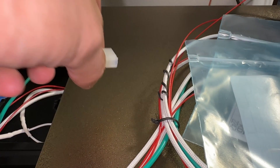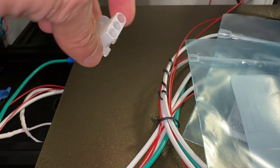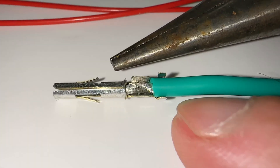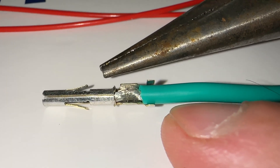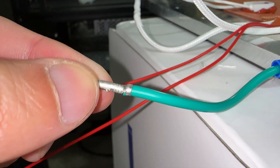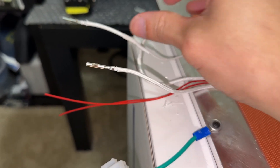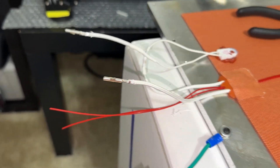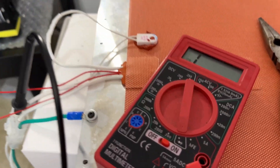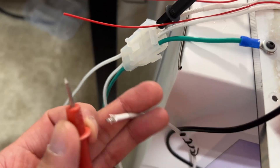I began looking up the legality of using spade crimps for these wires when I found this connector and remember buying it from the sourcing guide. The Molex connector pins are specced for 14 to 20 gauge wire and the sourcing guide does not list a larger crimping tool for these. Many people can't justify a tool for only 6 crimps, so a workaround is using needle nose pliers to fold the sleeves and secure the wire — I'll link a video below. The heater wires have a protective covering that needs to be pulled back so you can crimp the wire insulation underneath. These wires must be secured since they carry AC voltage. Use a multimeter to test continuity on all these pins before inserting them into the connectors — removal is a lot harder.